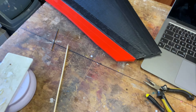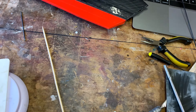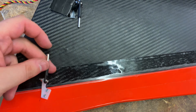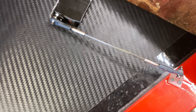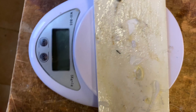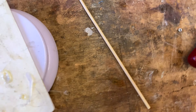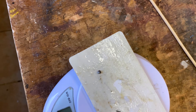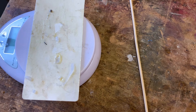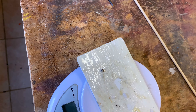Right, okay. So I've got the connection rods on the other end on both wings and I've also done our carbon fiber rod. Here's an example of roughly how it's going to look when it's finished. I have the epoxy in front of an underfloor fan unit to warm it up a little bit. We're going to mix it up and use it to put the rods together. I'm going to take them all off first because I think that will make a lot more sense, and hopefully by then the epoxy will be nice and warm.